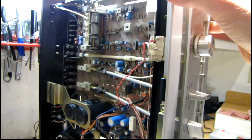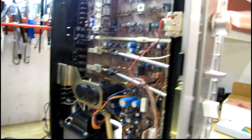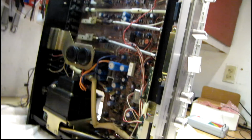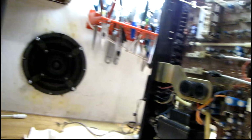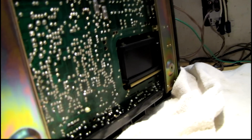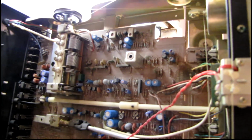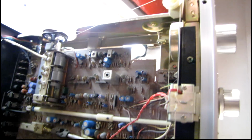Oh man. Yeah, I'm not going to leave that running because one, I don't want to cause any further harm to this, and two, I don't want to mess up my speakers again. So definitely got to change a bunch of caps and check solder joints, and maybe I'll change a few of the worst caps in the tuner there to see if the tuner improves.